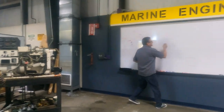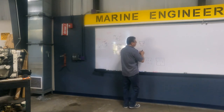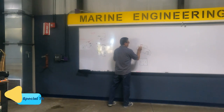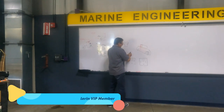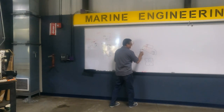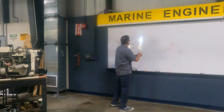We are going to make a picture of those relays. We are going to create our cranking system. You remember, in the cranking system, we need the crank relay, no? And we are going to install the starter motor. In the starter motor, we have two big terminals, and the second one enters the coil of the motor, no, guys? Right. And you have one small terminal here for the signal, and you have the ground. Normally the ground is in the body of the starter.